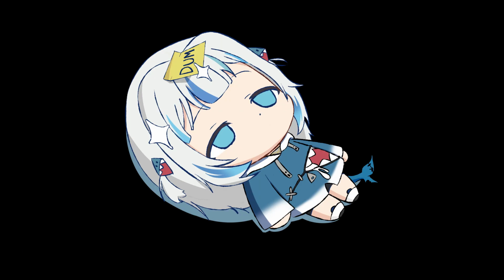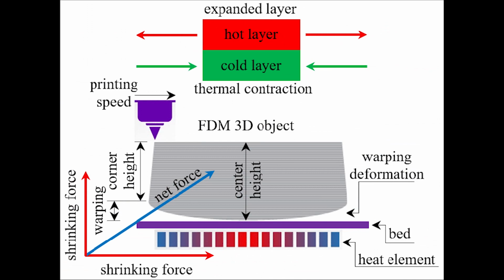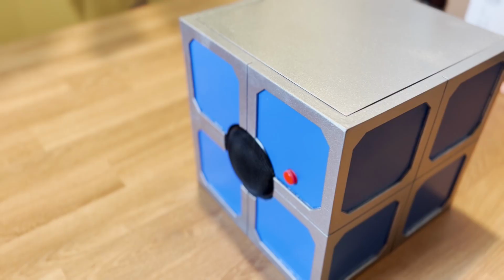I've lost count of which number setback this would be. Now I know I've complained multiple times in this video that I had some warping issues with the 3D printer, but this time it actually caused an operational issue. The sidewalls are actually slightly curved inward and pinching the lid, making it so hard to open that the servo just rips the hot glue instead.